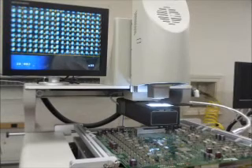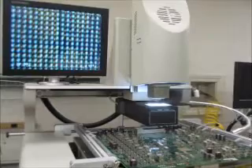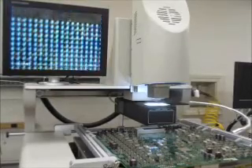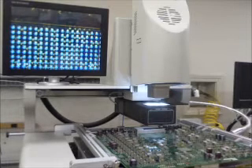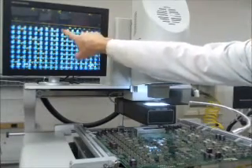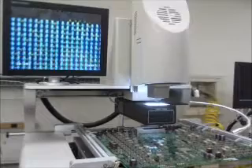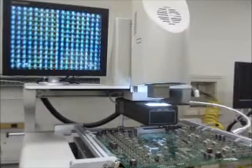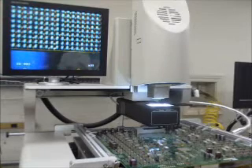We'll work this up and down until we make sure that the lines are perfectly straight. I'm looking at the solder ball here and the pads there. They're straight up and down vertical.